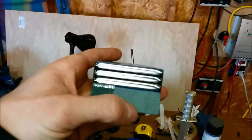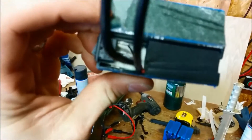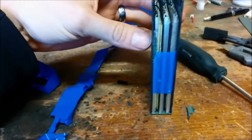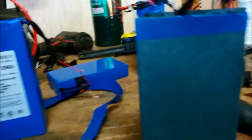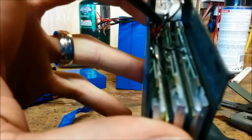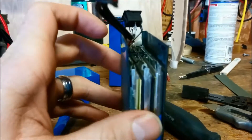I have this pack a little further apart now. Here you can see the three cells, and this is the top with the switch. I can see some circuitry in here on top of each cell, so I'm optimistic that maybe these are balanced and I will be testing that. This is inside the infamous 9800 milliamp hour Chinese blue lithium polymer brick. There's a tiny little board on top with some sort of circuitry — overcurrent or something. I don't see any way of balance charging them unless these circuits somehow cut the voltage off as you charge.